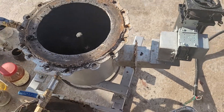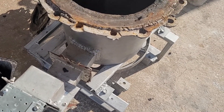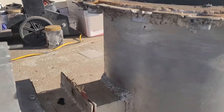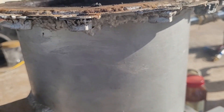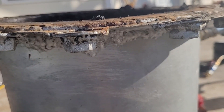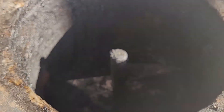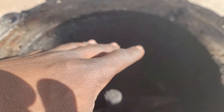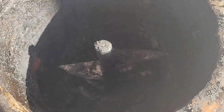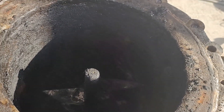So my plan is to keep this bottom port but seal it up so no microwaves can leak — it'll just be unused. Then I'll put another waveguide up at the top. The microwaves will still come in from the side, but higher up. This should solve the uneven cooking issue because the microwaves will bounce off the walls and more evenly cook everything. At least that's the theory — we'll see.